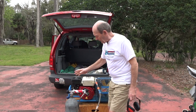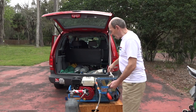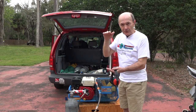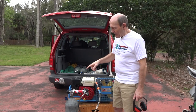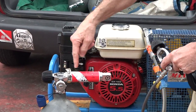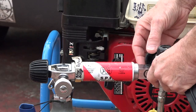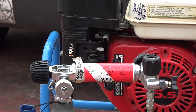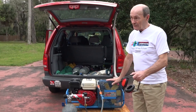These smaller compressors do have filters. Jerry's compressor has a filter that he changes after a set number of hours, tracked by its hour meter. He buys a new cartridge and installs it so he knows the air coming out is safe to breathe. But Jerry has gone an extra step — you can buy a supplementary inline filter that goes right onto your scuba tank fill whip. This extra filter is renewable as well, so any contaminants that slip past the main filter get caught here. Air going into the tank is good clean breathing air.